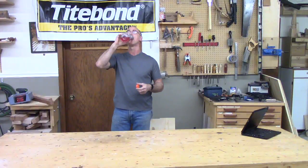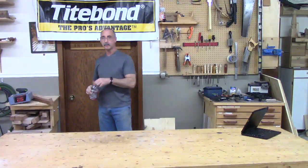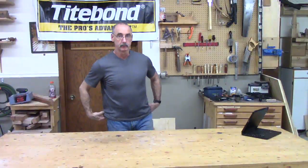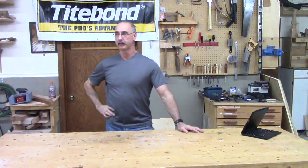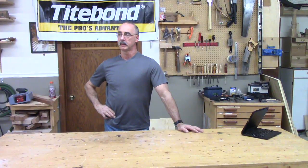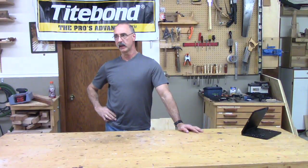All right. We have a viewer who wants to know, what is your favorite finish for outdoor furniture like Adirondack chairs, and why? Well, I can tell you what I used to do a lot of was linseed oil and mineral spirits, half and half. That soaks in really well. You've got to be prepared to do that about once a year. It looks great on an Adirondack chair. Very easy to apply. Do multiple thin coats to build it up.